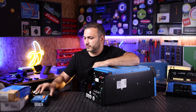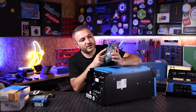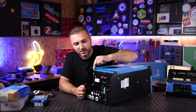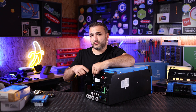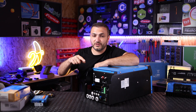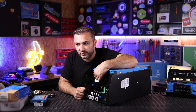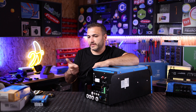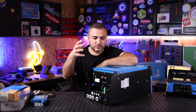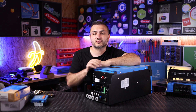As you can see, this is an old GX device — it has some ports on the back: it has VE.Bus, VE.CAN, USB, and also Ethernet. The same ports are available on this Easy Solar. As you can see, you have the VE.Direct port that gives you the possibility to add another MPPT. For example, if you have three MPPTs, you can connect them via VE.CAN, because you have two VE.CAN ports — basically make a daisy chain between inverters and the last one connects to the inverter. You also have a USB port, which gives you the possibility to add a modem, a tank sensor, or a USB switch, allowing you to add many USB devices to be seen in the same Victron Energy interface. And finally, you have a network cable port that gives you the possibility to connect the inverter to the network via cable. I strongly recommend connecting via cable.